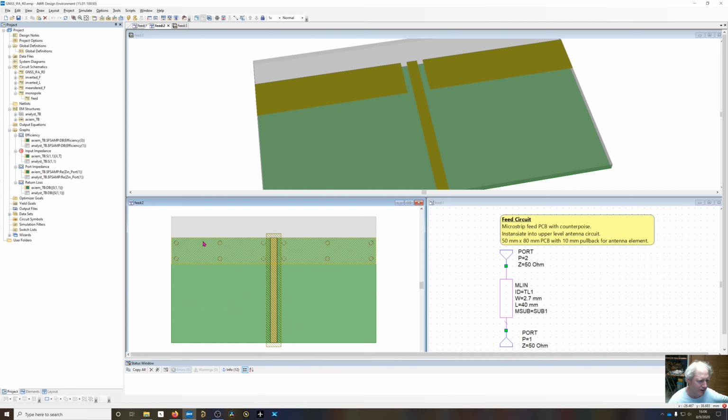So it's also important to have good shielding up here. In reality, we could probably throw more vias in, but since the inverted F is going to be diverting some of its currents back to the ground plane, we need to have a way for those currents to get back down to the main ground, which is carrying the microstrip's return currents.